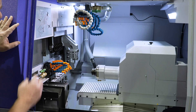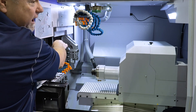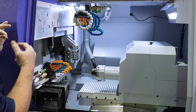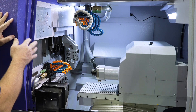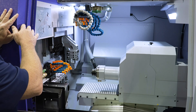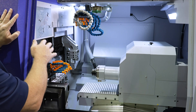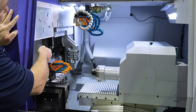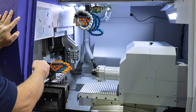Specifically on the machine, the dovetail construction is overhead for the turning tools right here. That allows for rigidity. As opposed to using a linear system, it is full dovetail, and it's set up in a manner engineered so that the angle of that dovetail construction meets with the cutting tool right at the cutting point on the material.